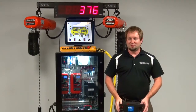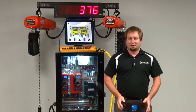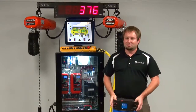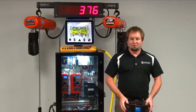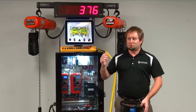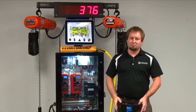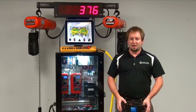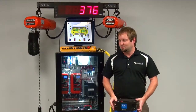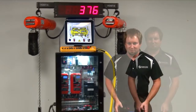The overall goal of this feature is safety — to prevent the overloading of a single hoist, or a bridge structure or a trolley structure with multiple hoists. When each individual hoist or sum total reaches an overload threshold configured within the drive, it will prevent motion, which leads to increased safety to the structure or personnel.